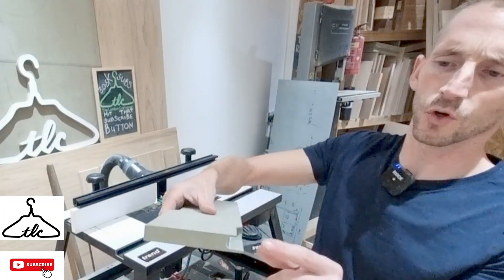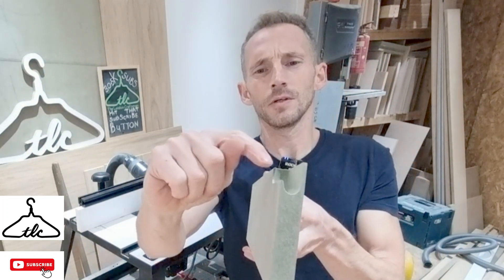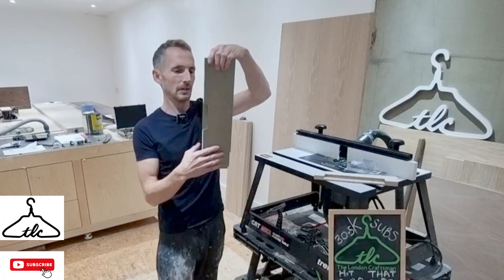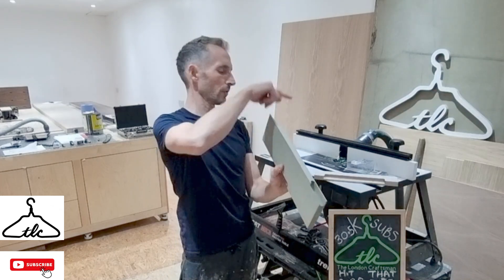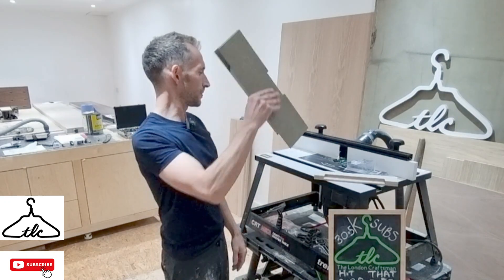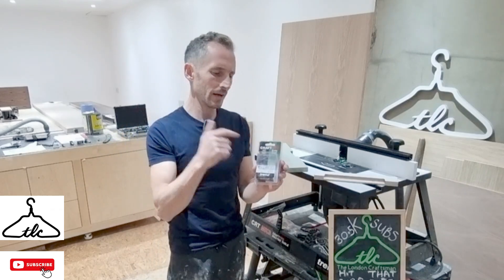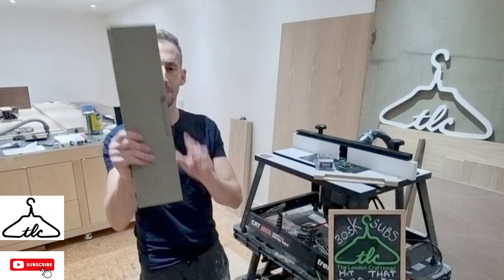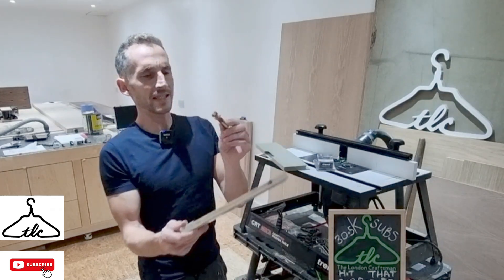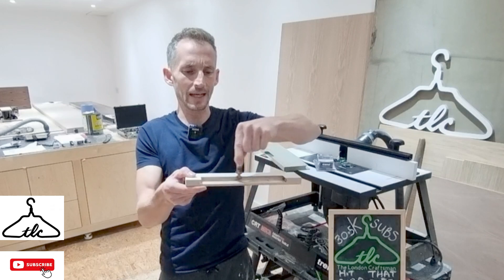This one was the first pass — a really fine tip. Then we raised the cutter and got a slightly fatter tip of about 2–3mm, which is what we went for. So there you have it: one finger pull handle. You can do a continuous run from start to finish, or set up pencil lines on the fence for the inset handle. That's using the medium cutter. This smaller profile was created by the smaller version, so you've got small, medium, and large versions of these finger pull cutters. You simply drop it in the router, rout across, and clean it out.